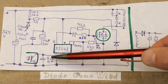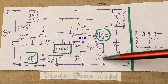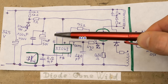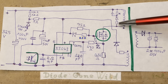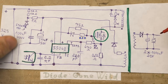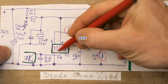Here is the feedback pin connected to the optocoupler. This pin is not used. This is the current sensing input pin with the current sensing input resistor, a filter capacitor, the current sensing resistor in the transistor source, the source-to-gate resistor, and the gate output going to the gate via a resistor and a diode so the gate discharges faster than it charges. Here is the snubber. In this circuit these capacitors are bad, the transistor is bad, this resistor, this resistor, and these three components, and of course the chip.